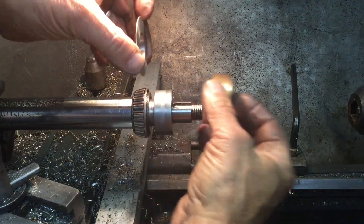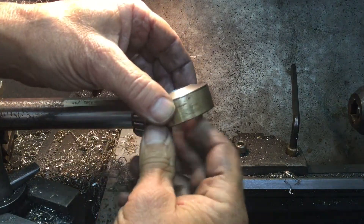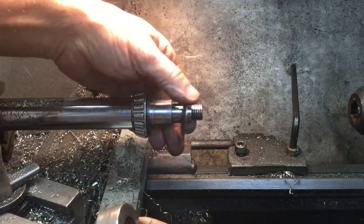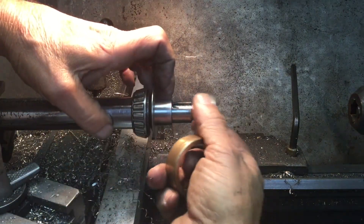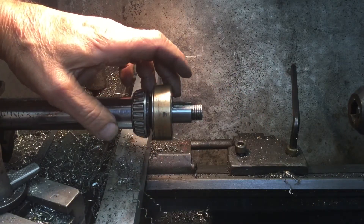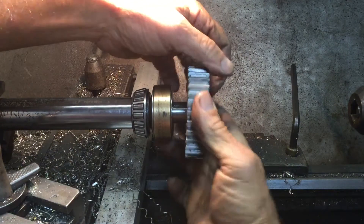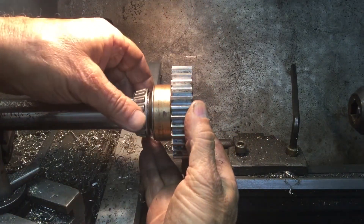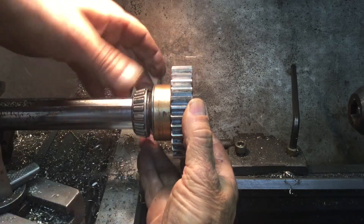There was a reason for doing that. If you look at it, it's just slightly smaller than the bushing. So the race goes in here, sits up against there with room for lubrication. The next piece goes in place, this goes next, and finally the axle gear goes in place. Now I don't have any play — the only thing you see moving is the outer cage once I pull it down tight.